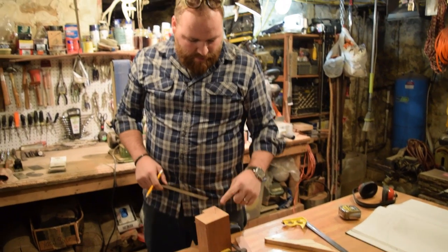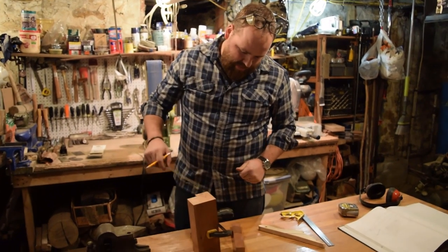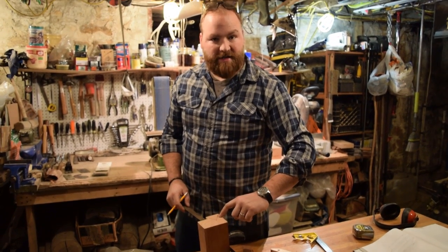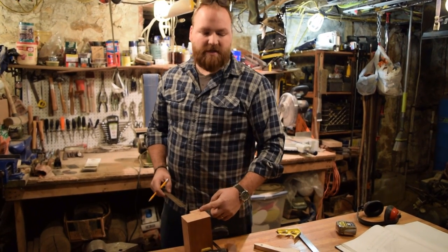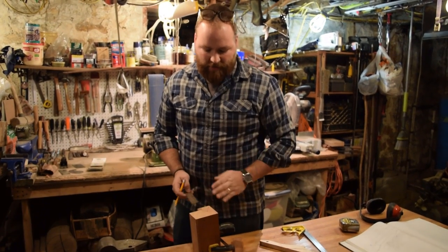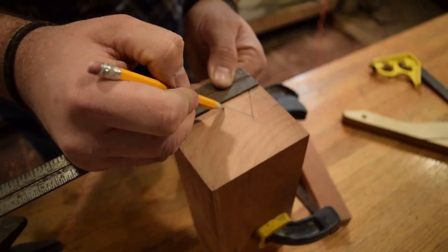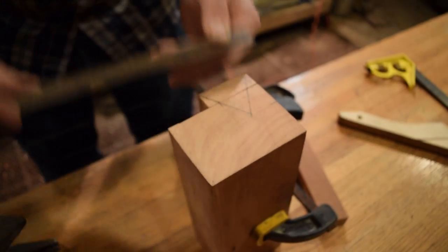Now to get this triangular piece of wood out, I want to keep these together. I don't want to move this over because I want the grain inside here when I cut this off to match the grain on the other piece. So instead of just doing a triangle from this end, you lose a little bit of cherry, but it'll be worth it when those two pieces of wood line up and you see that grain carry through from one piece to the other. We'll trim off here and here, and cut these angles on the bandsaw.